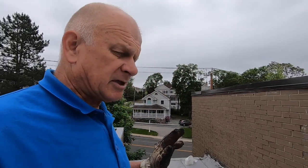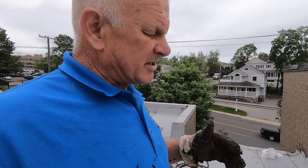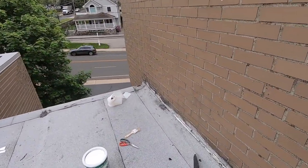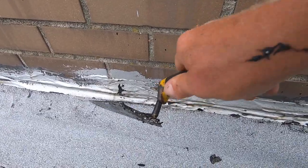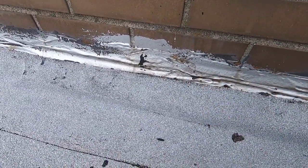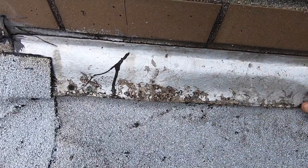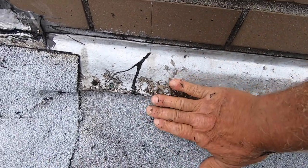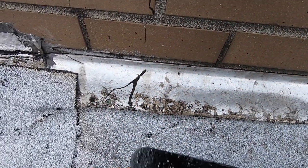I didn't make a video of how bad it was, but the flashing on the wall is the most common place where water leaks. They had so many problems and so many people tried to fix it. You can see people have silver-coated this and tarred everything. I brought my roof membrane all the way up the wall. The flashing was covered in tar and there was no way I was going to be able to undo everything and bring new flashing in - I should really put new flashing in there but it's hard once it's set.